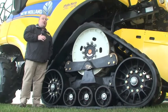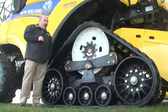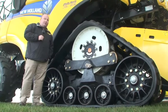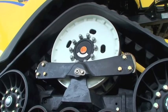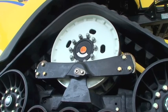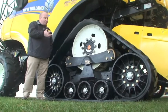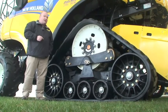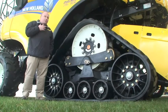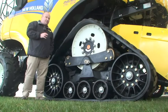The technology itself is in-house. It comes from the CNH side of the family and, as I said, available for all models from this season on, on the CR. The triangular design with the elevated drive sprocket means that we can keep the ground clearance under the machine at its maximum. The sprocket itself has positive drive with the lugs on the inside of the belt and this, in wet and slippery conditions, makes sure that traction is maximised at all times.